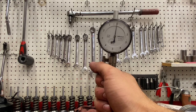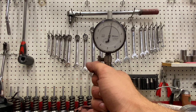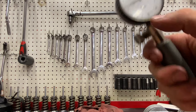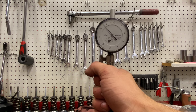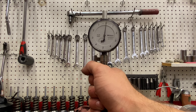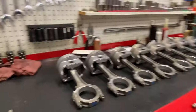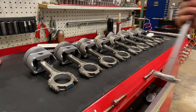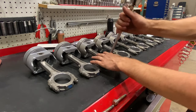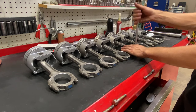Each little mark on this gauge is 1/10,000th of an inch. And each singular mark, the big numerals are 1,000. So this is going out 4 decimal places after zero. How accurate we're trying to set this and measure right there. So come to our rods next, and we'll make sure we all have the appropriate clearance for this application.